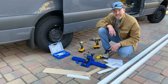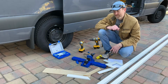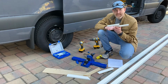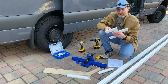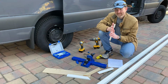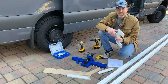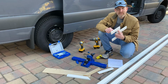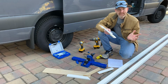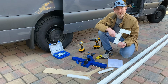So I'm going to spend today cutting and cutting and cutting, and then, like I said, I'll move to the next step, which will be to attach them all together, then route the inside, and then affix the back with 1/4 inch plywood, and then put my holes in for the hinges, and then I'll paint everything, and then I'll assemble it onto my cabinets. So time to get going.